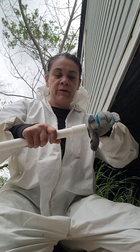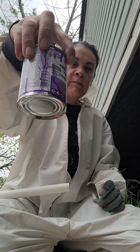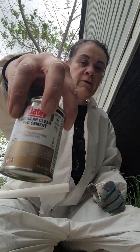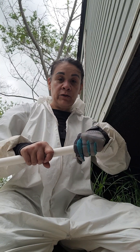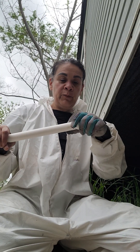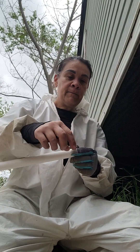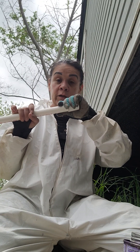Your broken piece — cut it, prep it with the purple primer first, then go around with the cement and slide it on. It does dry fast so you've got to work quick. Then get your new PVC, do the same thing — put your purple primer, get your cement, stick the new one on, and connect it.